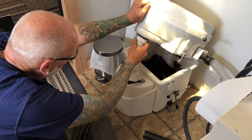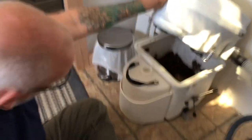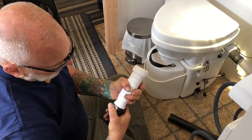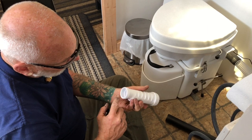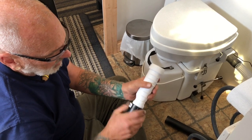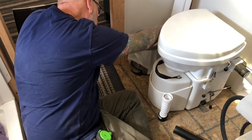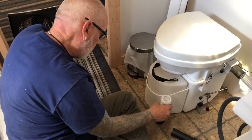That's like wide open — just a little spigot there. I can just get a male thread — one of these fittings — because this end has got that taper too. There's a spot for that taper to hit and it seals. I'll go see if I can get two of those and have that plumb down into the gray tank right below.